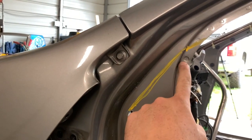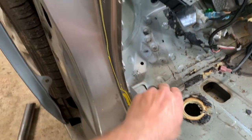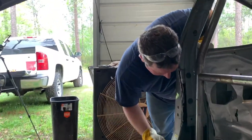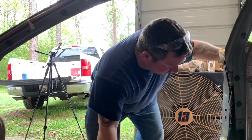The next step is we're going to take out the A-pillar and do the same thing. You can see where Paul has marked here, so we're going to cut that out to give us plenty of room to weld and get the A-pillar hoop in there. It's going pretty smooth so far. The biggest thing is just getting everything out of the way, getting it clean, getting it where we want it, and seeing where our halo is going to sit in our front down bars.